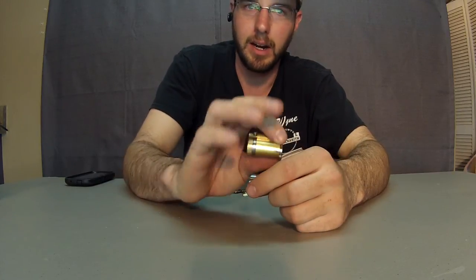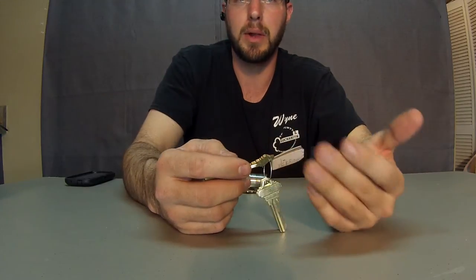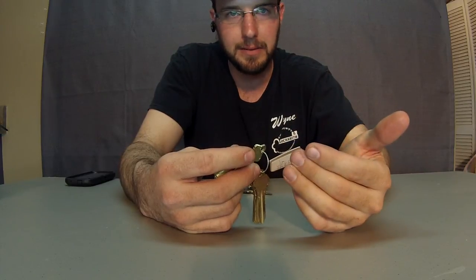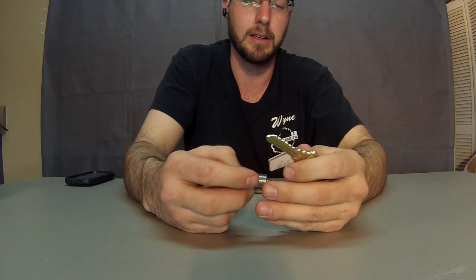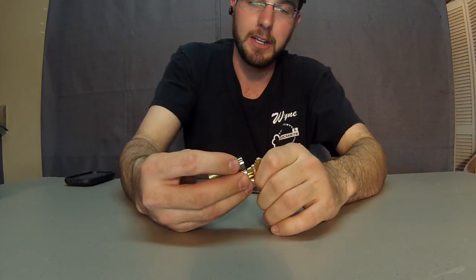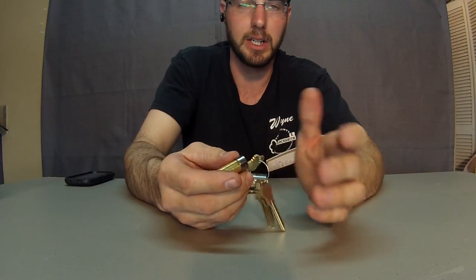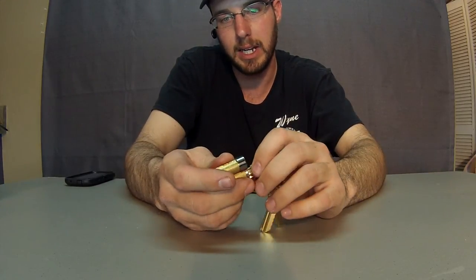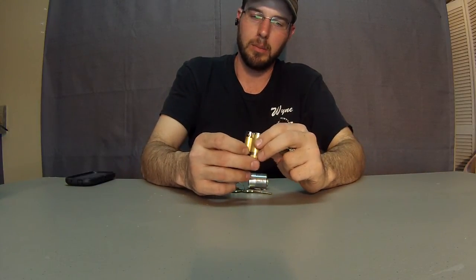You can set somebody up with this, set it up throughout the whole facility, and then supply them with an extra set of cores that you build for them. When they fire somebody, have a security breach, or somebody loses a key, they go around, pop all the cores out, put new cores in, and hand new keys out. Then you just have them give you a call or bring the old cores by, and you rekey the old cores and send them out with new cores that are rekeyed again. It works out pretty well for all parties involved.